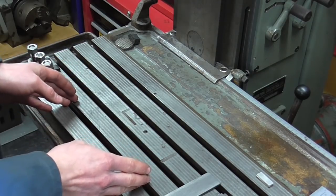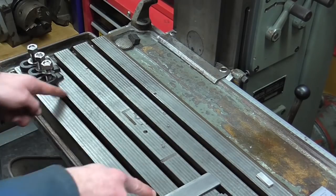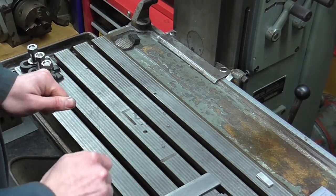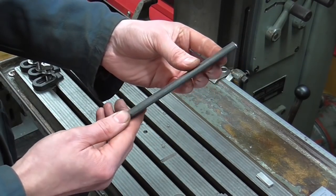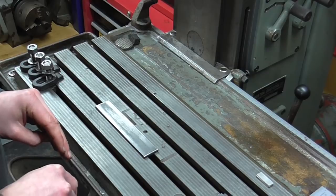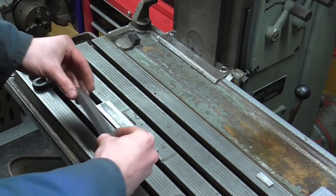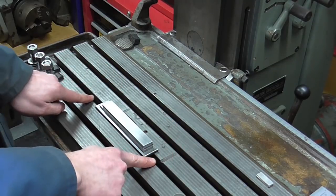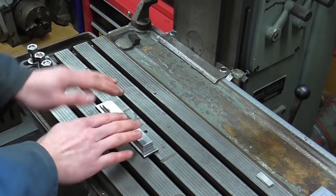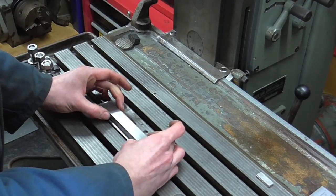Here at the DECKEL FP1 I'm going to proceed with my clamping setup for the first operation. Should you own a mini pallet - one of those fancy blocks with all the drilled and tapped holes in it and the nice little clamps to suit - this would be a good time to use it. In lieu of one of those, I've taken a piece of plain old hot rolled steel, given it a draw file up, got it nice and parallel and flat, and that's going to be a sacrificial piece. I'm placing that roughly in the middle of the table and onto it is going the stack of gauge plate. I'm straddling a T-slot here - not because I want to, but because for the subsequent operations I need to clamp from both sides.